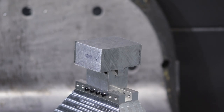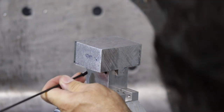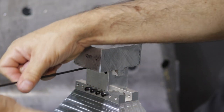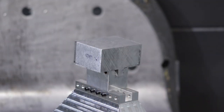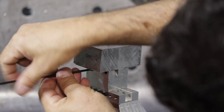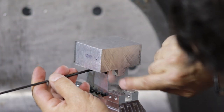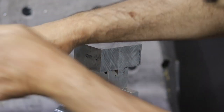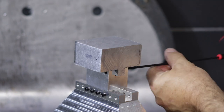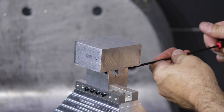And I'm basically doing the same thing that those serrated biting vice jaws do. I don't know what they're called, but the ones you see that other people use on YouTube. Well, here I'm just using individual set screws with a sharp point to dig into this aluminum tab in this frame here. And this has been enough so far to hold my stock in place. And then there's more set screws on the back, and I'll tighten these up as well. So we're gripping from both directions.